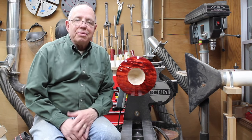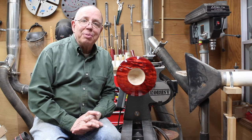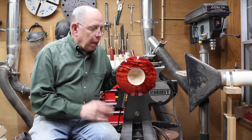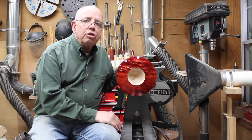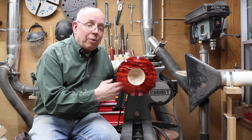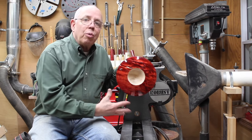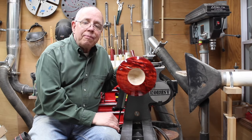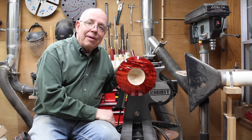One of the things that happens when you've never done this recording stuff before is you run out of room on your disc — I used up too much memory and forgot to delete some of it, so what I was finishing up there ended up not being recorded. But I did wax it and I still had some hairline scratches. So I used my Beale buffing system — put on my Tripoli, buffed it out, then used White Diamond — and that got rid of all my fine scratches. So instead of using all that polish and stuff, I think I'm just going to go with the Beale buffing system after my micromesh sanding. Hopefully that gives you some additional tips on how to put a CA finish on a dyed bowl. Thanks for watching. Have a great day and God bless.